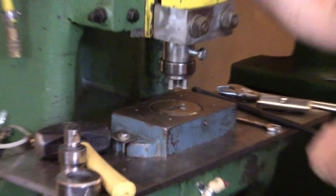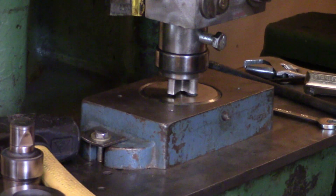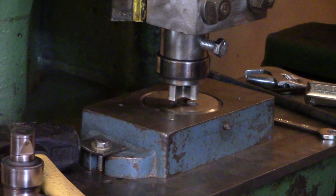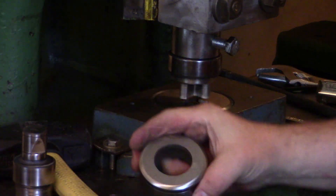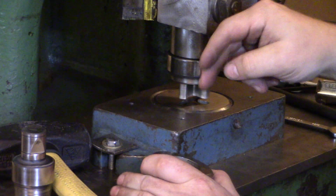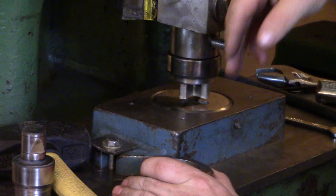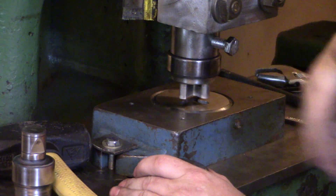At this point now, if I cycle it again, you can see I'm happy with the clearance. I kind of inched in there nice and slow, and I know that it's going to pass through nice and clean. But the difference is, now if you look, you can set this depth and it's going pretty deep right now. And what we're after is what's called a brake clearance. There's a flat spot just inside the die where it's referred to as a landing. When the piece gets blanked, you really only need the punch to push through the material enough to break the piece out of the strip. Anything beyond that, you're increasing tool contact time, increasing clearance issues — you're basically going beyond what's necessary.